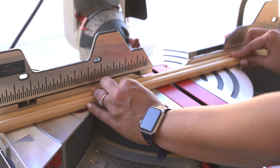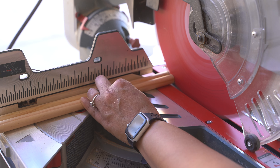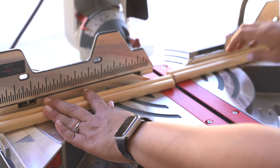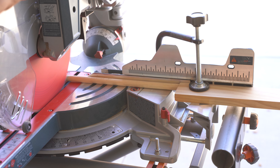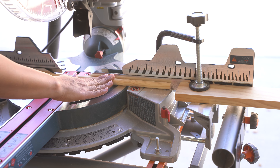The drying rack is made up of round dowels. I used wood dowels because they are super cheap and easy to cut on my miter saw. But you could obviously use steel rods or aluminum rods as well. The key is to make sure that all of these rods are exactly the same size, so I set up a stop block on my miter saw and made all of the cuts.